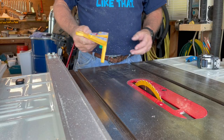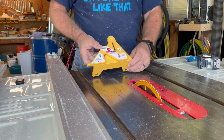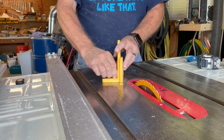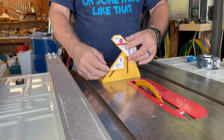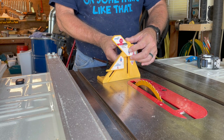It will show you the center of up to three-inch thick material — you place it on top and it shows you exactly half. It's got a magnetic base for your router table or table saw, fits really tight, and has screws on the back. Just loosen those, raise it up to where the halfway point is set, and lock it in place with the screws.